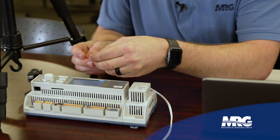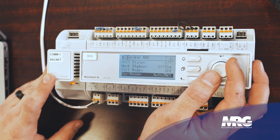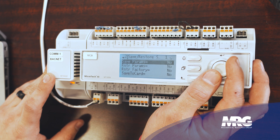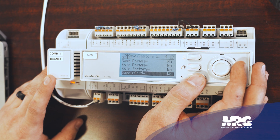Insert the SD card into the controller with the sticker facing away from you, and slide it into the slot on top until you feel and hear an audible click. Now scroll down to the Service Settings menu, then scroll down to 'Save/Restore Settings.' Select 'Save to Card' and change that value from No to Yes. This saves the controller's configuration to your SD card so you can restore it after the software update. To confirm, you can extract the card, put it back in your computer, and check for additional saved files.